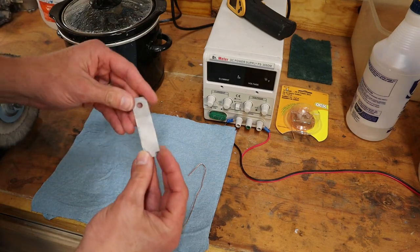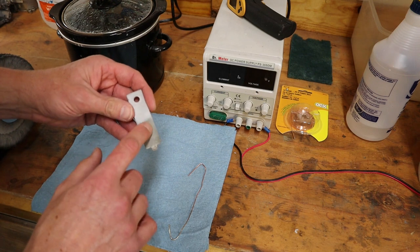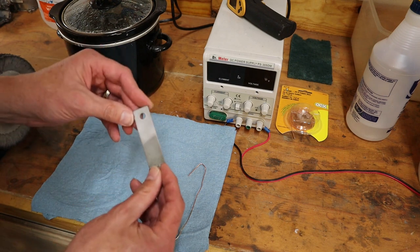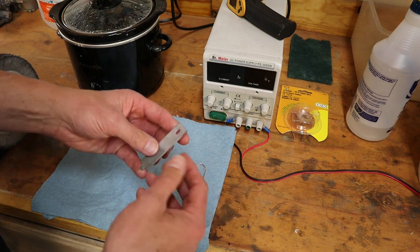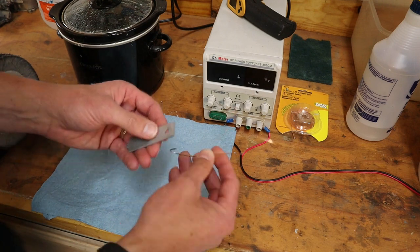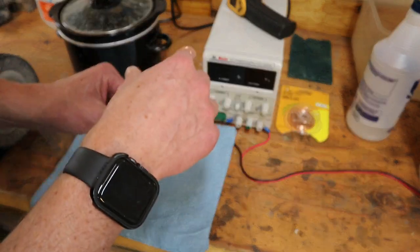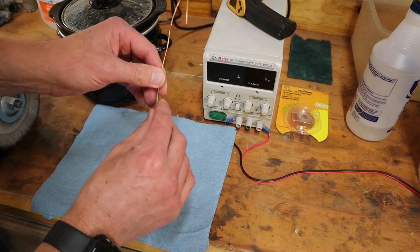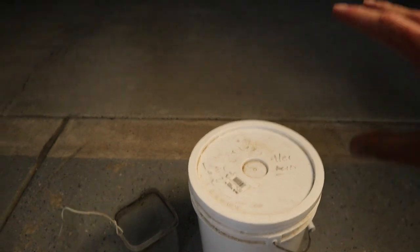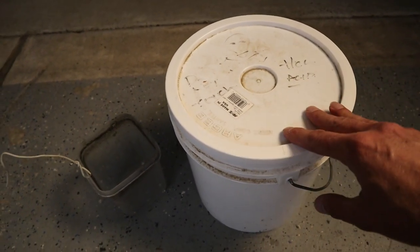Now that we've measured our part — this is the one I sandblasted, so it's very rough in texture — there's most likely still some old plating on it. I want to take this to the acid bath and let it sit until it stops bubbling, which means the reaction to remove the old plating is done. I've got a piece of copper wire cut from our roll, long enough to hook on the copper tube and hook our part. At the acid bath, you definitely want good ventilation — do not have this near your tools because it will flash rust anything metal nearby.